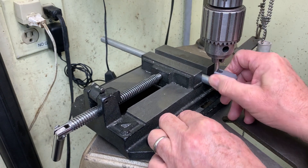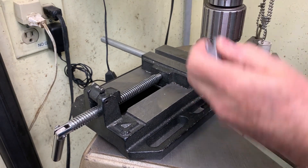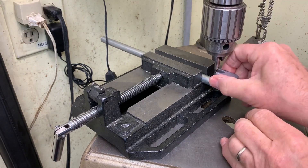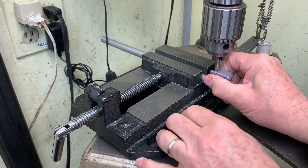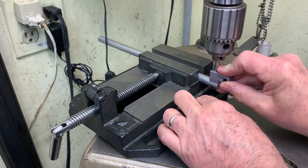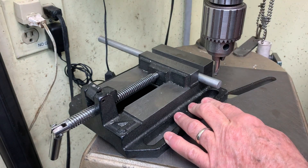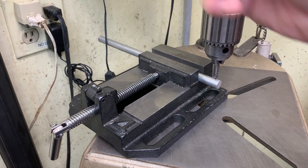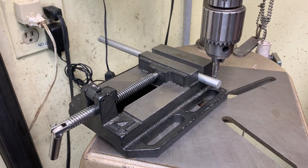And then when I park the cutter in that slot, now I'm at the quarter-inch point and approximately centered. So now I'm down on center. I'm not claiming it's as accurate as the steel rule, but it's certainly faster.